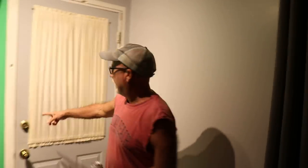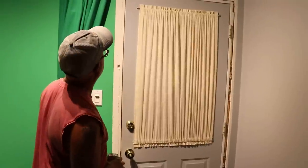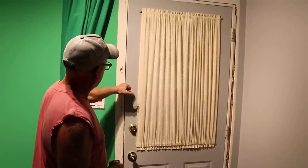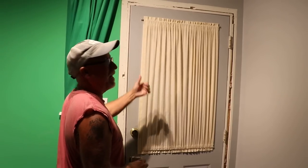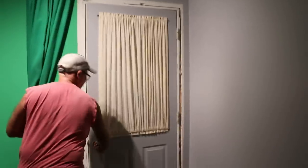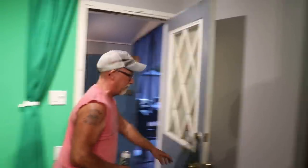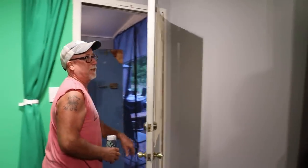I already took the molding off of here. You see what you'd have to take out right there - I gotta take nails and screws out. Take a real close look at it. Do you see what's wrong with this door? It has memory - like that - and if you leave it like that it just opens all the way by itself. It's not plumb, the whole thing's out of whack.